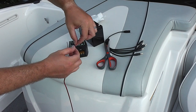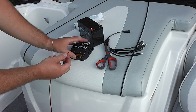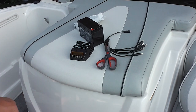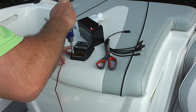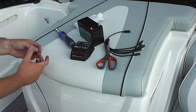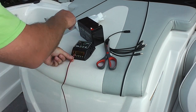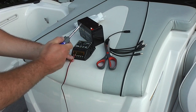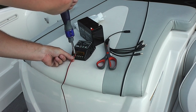There's my positive. So this is my solar panel, and I don't have it plugged in right now of course. I'm going to put the negative, the black, on the negative terminal, which is this one right here. I'm simply going to get a screwdriver and loosen that. You can wire this kind of stuff up directly, but it makes it so much better buying an inexpensive box such as this. As you can see, I just simply screw it down and it's going to make contact with this wire and hold it securely in place.